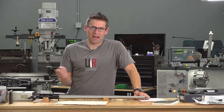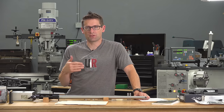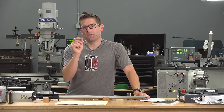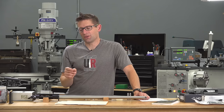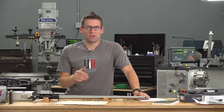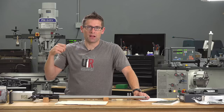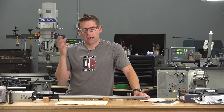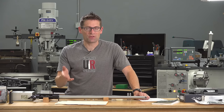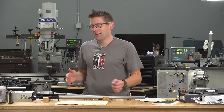I took multiple passes, going five thousandths on the 29-degree angle for the first several passes, then as the thread peaks started getting thinner and thinner I slowed down. I didn't have 32-thousandth over-wires available and didn't have anything threaded to this diameter and pitch to check against, so I just took it nice and slow with multiple fine passes — that's what this kind of work is all about.